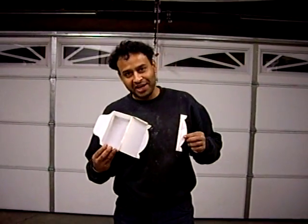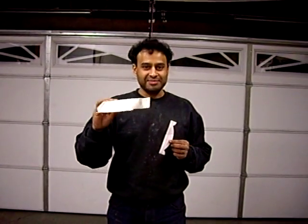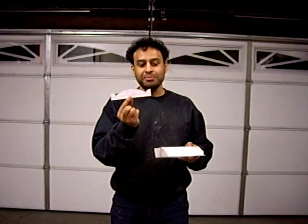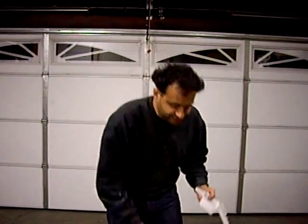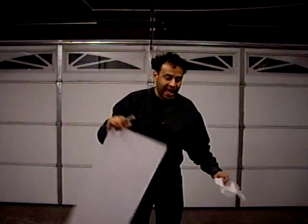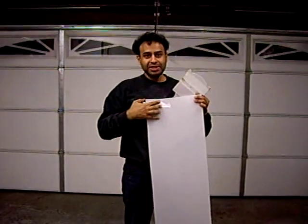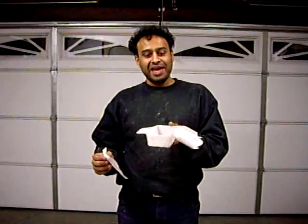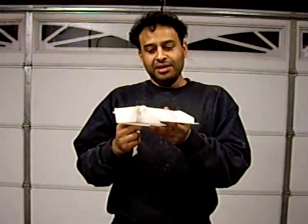Hello, Get Rich Quick Guy here. I had an idea to make a special dust pan. What I did is I actually printed stuff out using a computer — actual patterns that I'd be using. I got a flat piece of plastic from McMaster-Carr, glued the paper patterns down, cut out the pieces, taped them together with packing tape, and formed this dust pan.